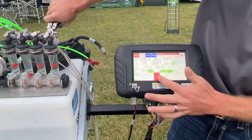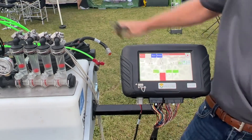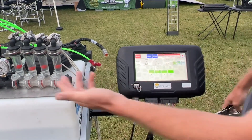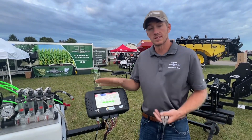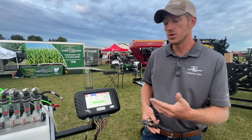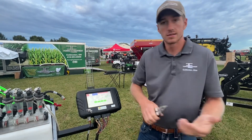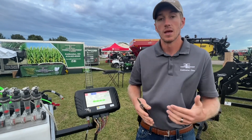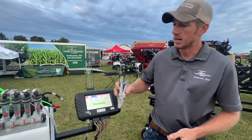What I'm going to do is crimp row number two — and there we go, row number two drops down and it would be giving us an audible alarm. I let go of it, it comes back up and everything's fine. So with both of these systems they very accurately and instantly tell you when you have a blockage.